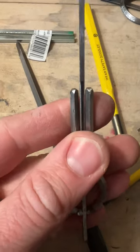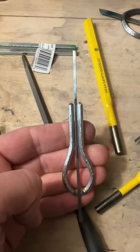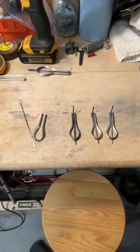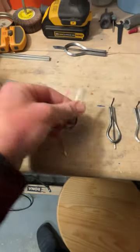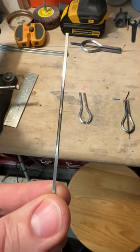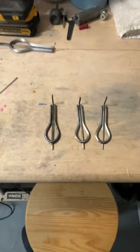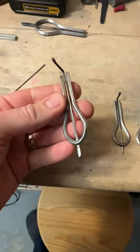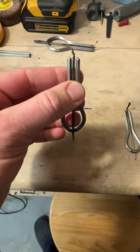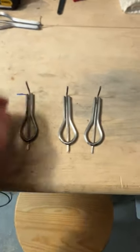It was bothering me too much, and the grinder was not a good idea — I was too worried about catching the reed, so I did that by hand with my file. I am done with this batch of spikes. Aside from this failure here where the crimp channel was just way too wide and I couldn't get it to crimp on the reed — the reed's still good, it's been sharpened, and we'll save it for another day. The reedject shall go with the reedject. The other three survived. This was the first one — it will be the prototype. I decided not to do any more heat coloring because it caused a bunch of deforming on the thin frame stock, and I had to readjust it. So I decided not to do that with the other two.